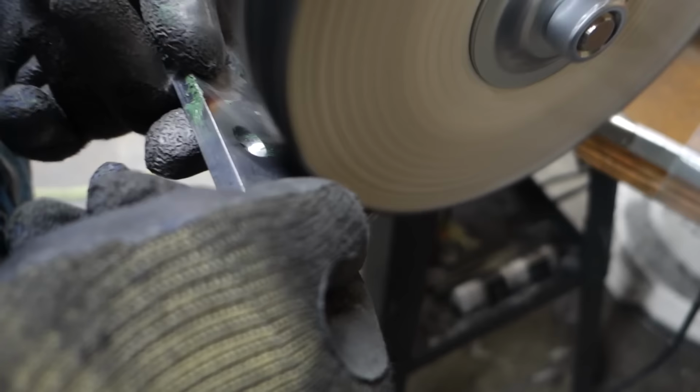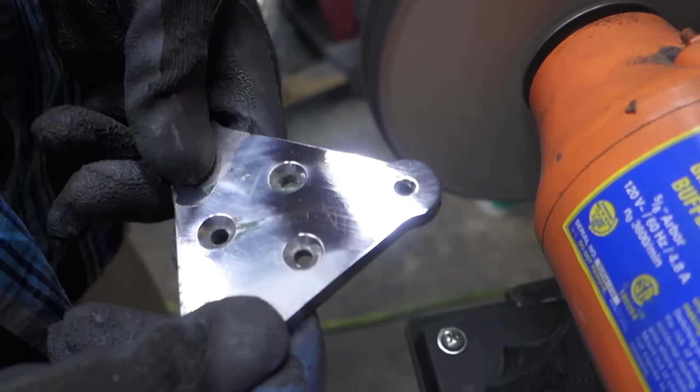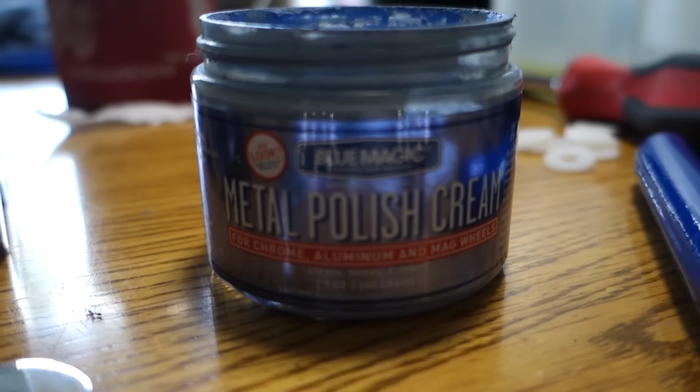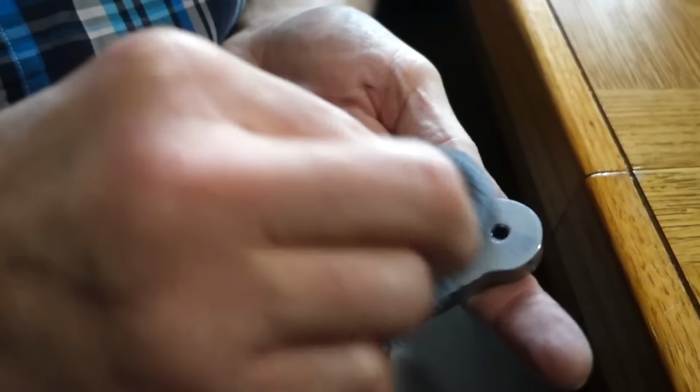The thing is a complete and total mirror, and it blew my mind, because every time I've ever worked with metal and shining up metal, it's 100 grit, 300 grit, 600 grit, 1000 grit, 2000 grit, rubbing compound, then buffing. Yep. And then it looks milky. And then wax. Yeah, at the end you have to wax it. It looks milky. You just did it in one step. Yeah, exactly. Didn't even have to use a coloring compound, as they call it.